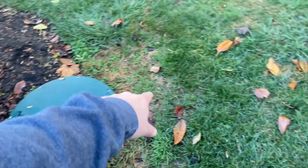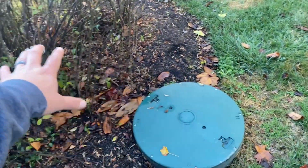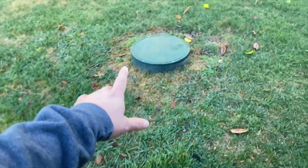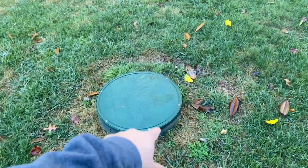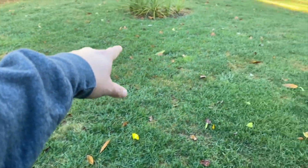The front, middle, and back of the tank should be somewhere over here. The tank is going to capture all of the solids — this is where you pump out the tank. From here we're going to have what should be a distribution box, and then a dry well there and a dry well over there. This type of system is very common in this area.